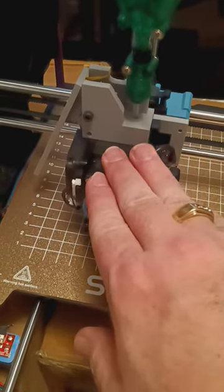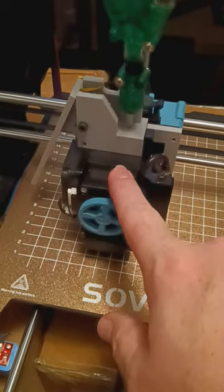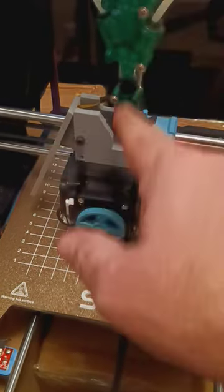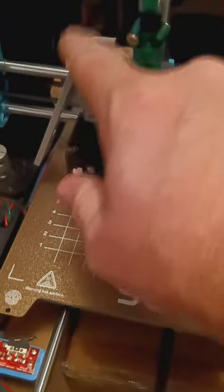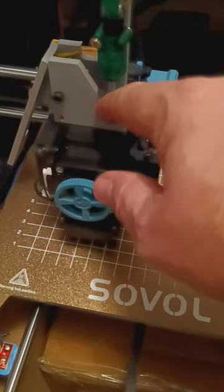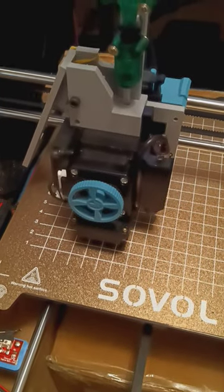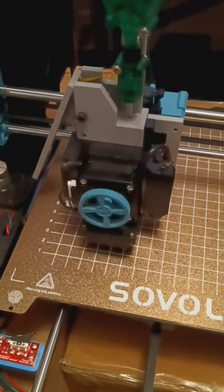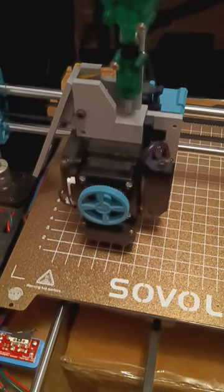The nice thing about this is with 3D Clippy, you never again have to worry about tip shaping, because you've actually chopped off anything that's going to be bad — you always get a perfect tip in and out of the Y adapter here. It uses a rubber band here just to reset it. And if I pulled this apart, you'd see the razor blade — it's a utility knife blade that goes to cut that off. That makes your tuning of any filament significantly easier because there's nothing to tune. You just slice it off instead.